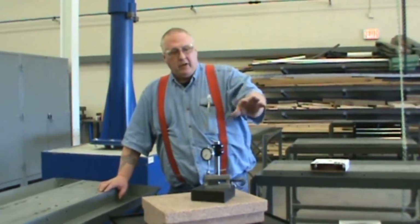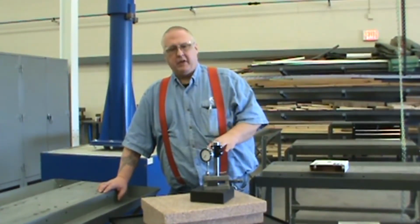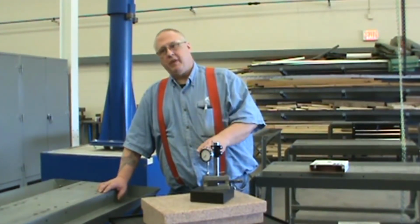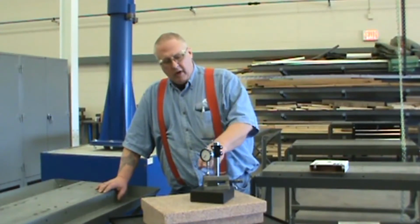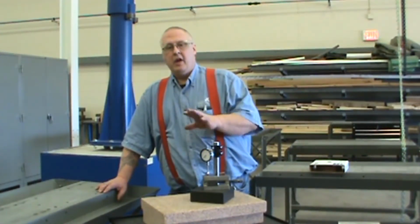So when you get into your finished part, don't freak out. You want to do your rough in right, pay lots of attention to it when you're doing it. And when it comes to the finished part of it, check it off. Once you've got one end flat, parallel, square, you're good to go.